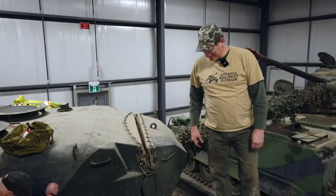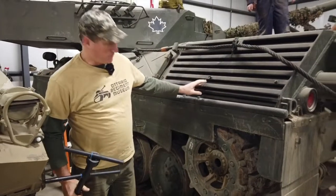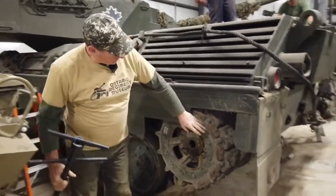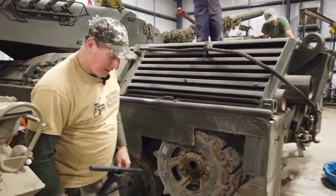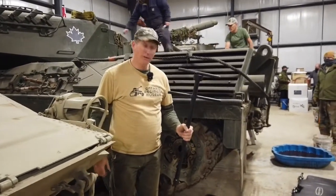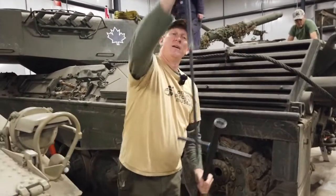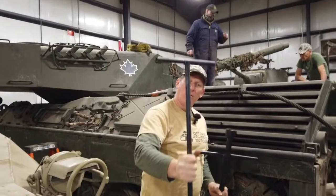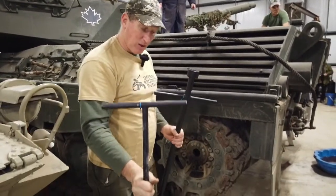Stay tuned, we're going to continue. Okay, so we're now at the back of the Leopard 1. This here is one of our final drive units — it's the drive sprocket for the tank. The tool that I'm holding is to actually pull the slip coupling out and disengage it from the transmission. It's a two-piece part. The long piece goes into a square hole that locks into the transmission and holds the output shaft straight and locks it in position.